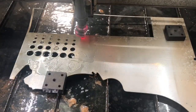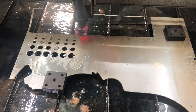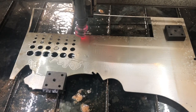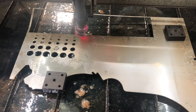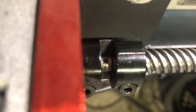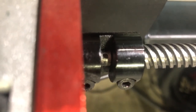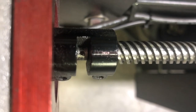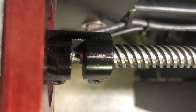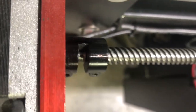That's everything with a 0.6 pierce delay. I'm not going to make you watch the 0.8 because it should be pretty much the same. I'll move this a little bit to avoid straddling a table slat, which obviously happened on the one-inch hole. Before we look at the data, let me show you what the Langmuir folks were talking about when marking the coupler to make sure it's not slipping on the shaft. You can see I've made a scribe mark on the coupler and a little mark on the shaft — they're lined up.